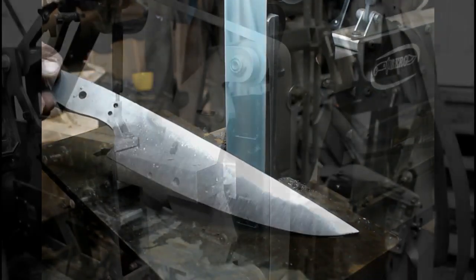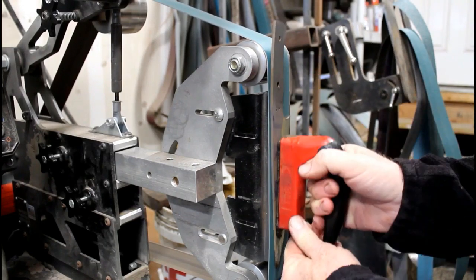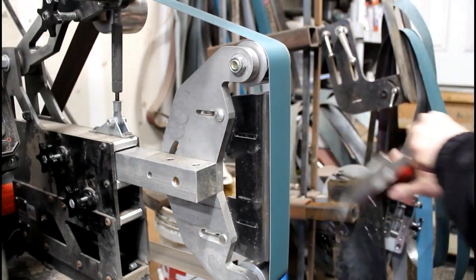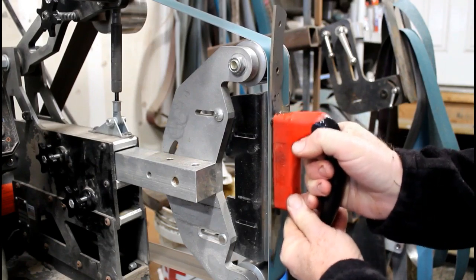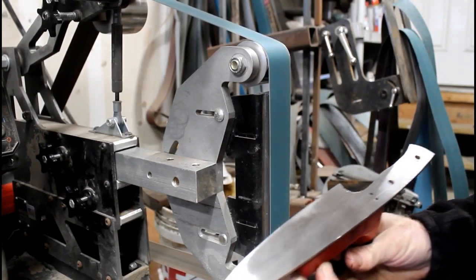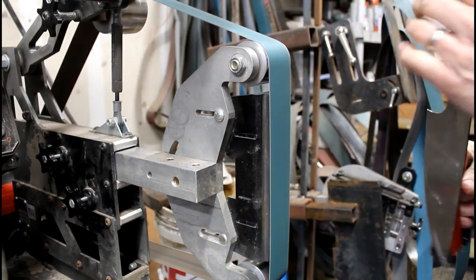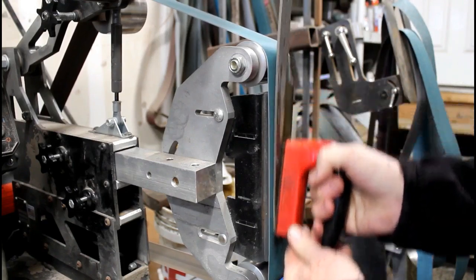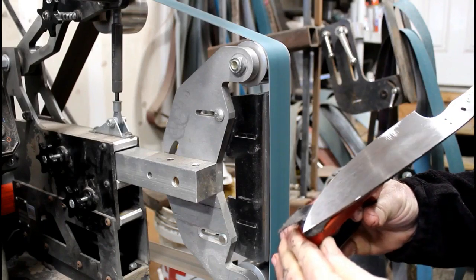Now I've got very coarse grit grind lines. I'm going to use a handled shop magnet and go vertical — I'm going to remove the 90 degree work table. I've also changed the grit of the belt — this is now a 60 grit belt, and what I'm doing here is just trying to get rid of all of the 36 grit belt grind lines and smooth them out. This doesn't have to be 100% perfect. We're doing the pre-heat treating bevel grinding now. I don't want to end up with any deep grind lines, but post-heat treating we're going to clean this all up again with a finer grit belt — an 80 and then a 120. Right now we're just trying to get rid of all of those 36 grit grind lines.